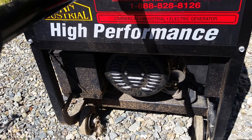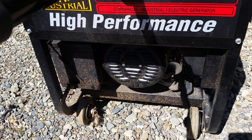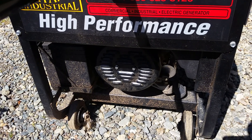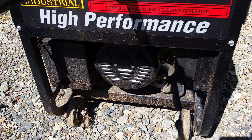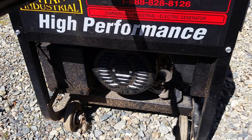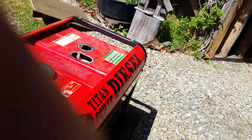On R1, R2 and L1, L2 I had three and a half volts — technically textbook too low. It should be five volts and I was at three and a half. So I said the armature is probably bad and pushed the generator aside. Then I checked the two lines that go to the capacitor. Be very careful with those caps because they'll discharge on your hand and knock you right in the dirt — tremendous amount of energy in a capacitor, like grabbing the spark plug wire on your lawn mower. Always short across the two terminals with an insulated screwdriver to discharge the cap before you remove it. I had 2.3 volts on the capacitor lines when I should have had five, which says the armature has problems. But then I thought — why not just buy another cap? It's only $17 shipped from Amazon. Maybe it's not as bad as you think.